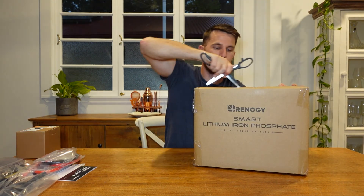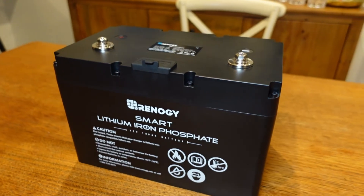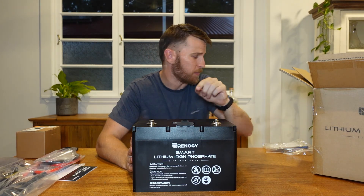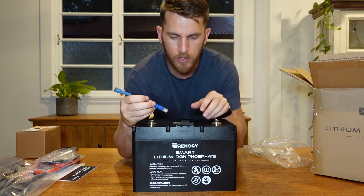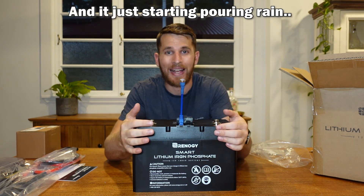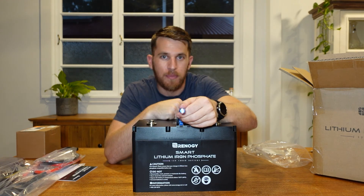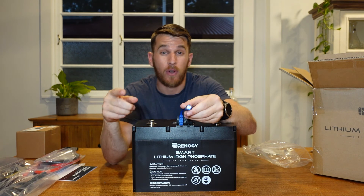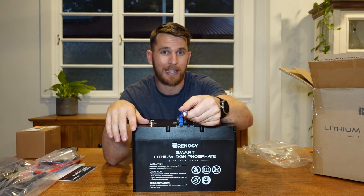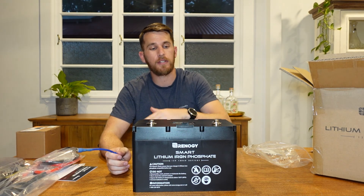So let's crack into it. And there it is — it's a pretty basic looking battery, but it does have a really good hard casing with terminals up the top: negative and positive. One really cool thing about these batteries is the link-up system. The battery comes with a cable and you simply link it up. On that button you should be able to see a small blue light — if you hold that button, it's going to activate the battery. At the moment it is in shelf mode. If I hold that button and release, the button has gone a very bright blue, so now I know that battery is active. And if I want to send it back into storage mode, I just hold that button for three seconds and it's gone back into storage mode. I'm going to keep it there because I have not built my system yet, but that is a super cool thing about these Renogy batteries — I can't wait to get them installed.